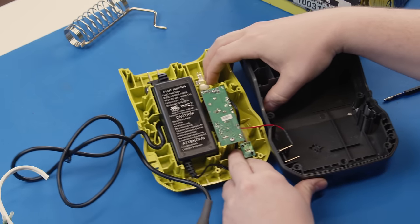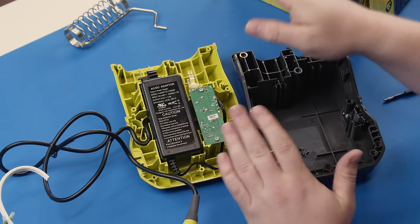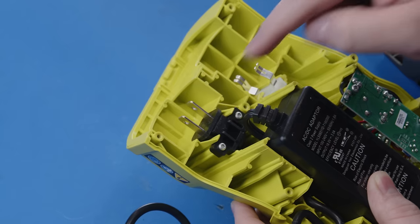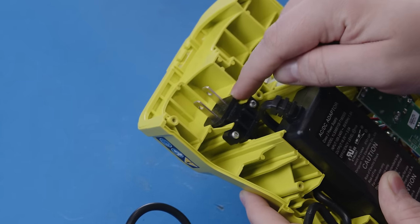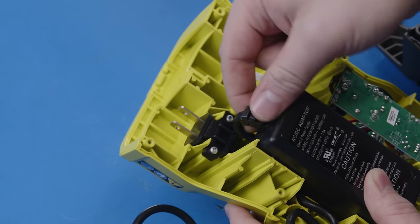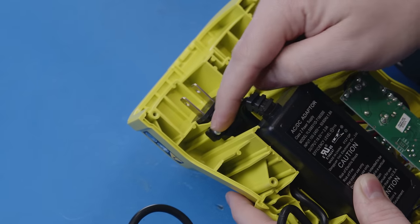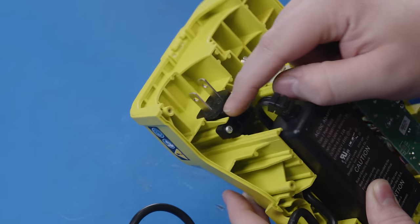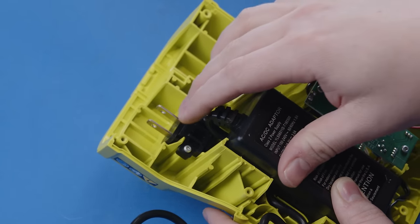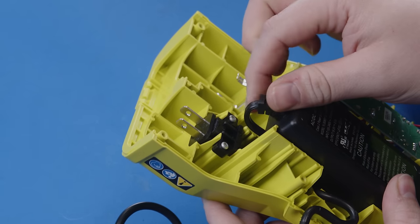But Ryobi has taken a much more literal approach to black box and actually bought a black box to put inside. And that goes so far that they actually kept the plug. Look at that. Isn't that something? That's the original 110-volt plug that came molded onto the cable that was staked into the box here from the manufacturer. All they did was wobble it up underneath and then build this little strap to hold it inside the chassis, and they only expose the face of it, so just the pins are sticking out. It's not even laziness. It's like working really hard to keep yourself from having to work hard.